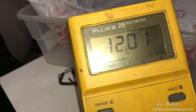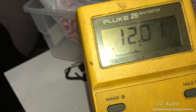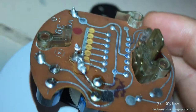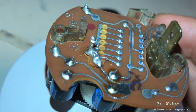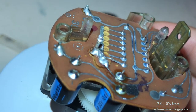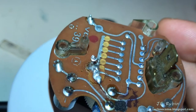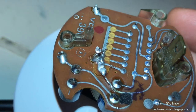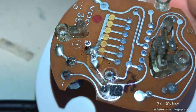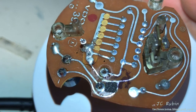Setting up a DC power supply at 12 volts, limited to about 20 milliamps — that should be safe. I removed the foam to get a good look at the board and get the connectors on. It looks like when someone previously tried to take this apart, they didn't know about the soldered ground portion. It was a pretty violent event — it broke off the phenolic material of the board as well as some traces.